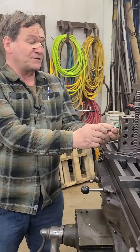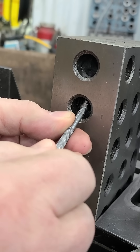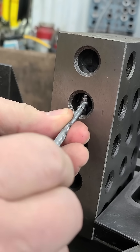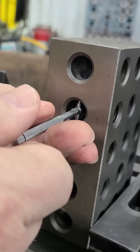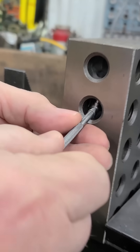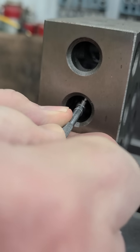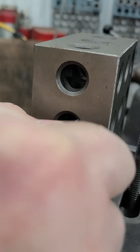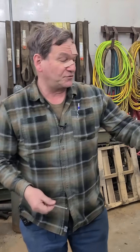After that I got to thinking about it and he was right. When you go back through the second time, what happens is this leans to the side a little bit. It just happens because it's near the size — you don't have as much force in the hole. When it's loose and you tighten it, it will self-center if you let it and come to the right size. If you put it in and it's already got a little friction, it'll push to the side and start getting smaller. As you can see, I can get it where it's really rattly. So anyway, that's what you do with holes.